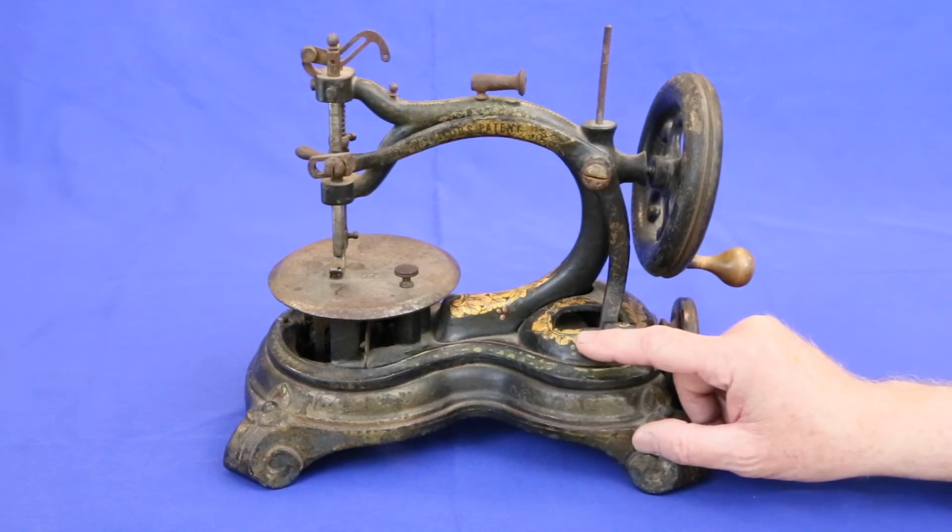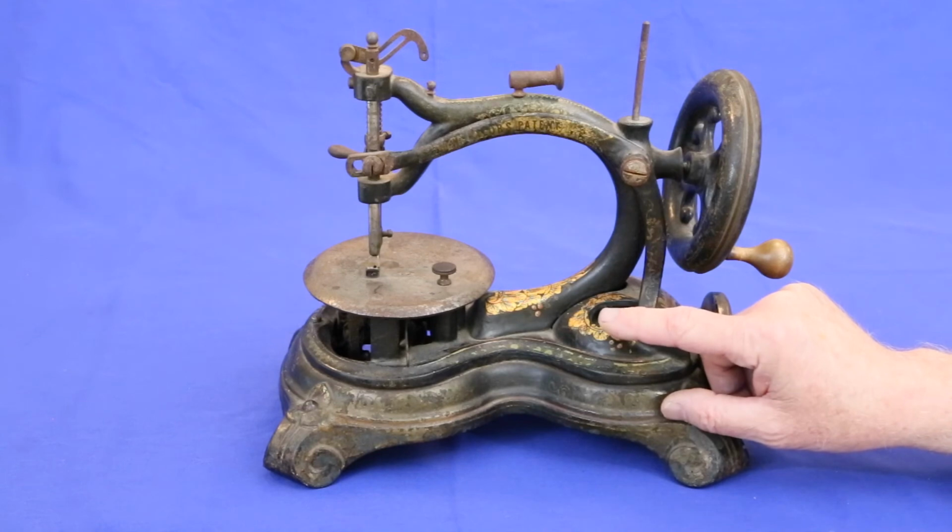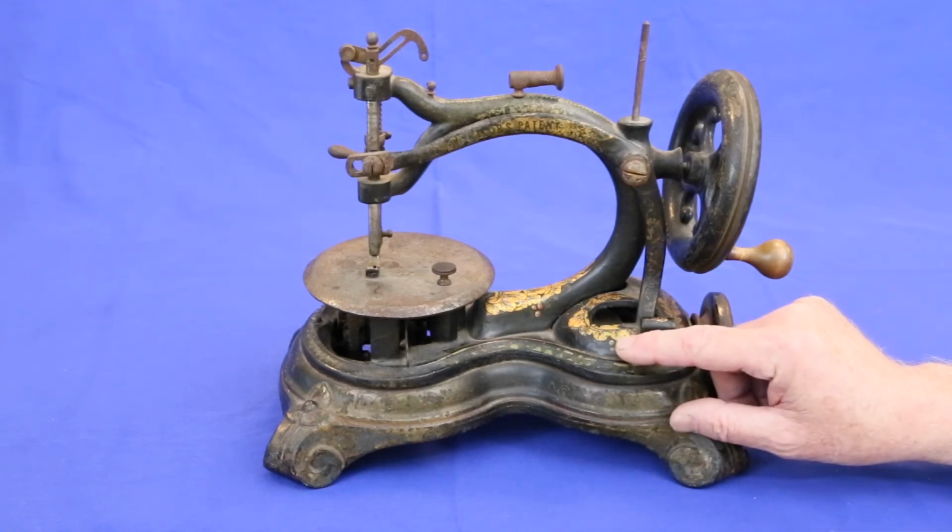The artwork appears to be a little on the, well, crude side. It was all done by hand, and the poor quality is surprising, especially considering that this would have been a high-end machine in its day. But what's very interesting about this artwork is that in a few places the shellac has been scraped off without disturbing the underlying paint. The surprise is it wasn't painted, but gilded with high carat gold leaf. It looks a dark yellow because the overlaying shellac has yellowed with age.